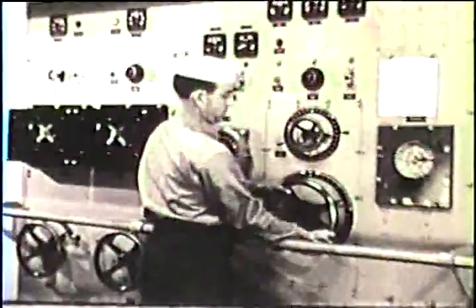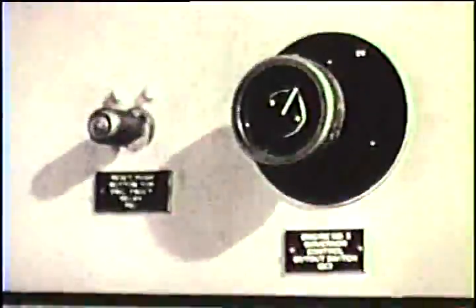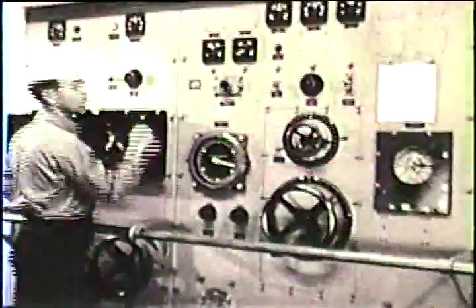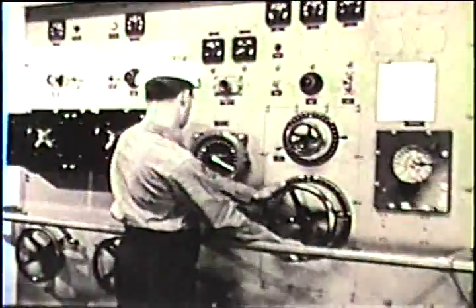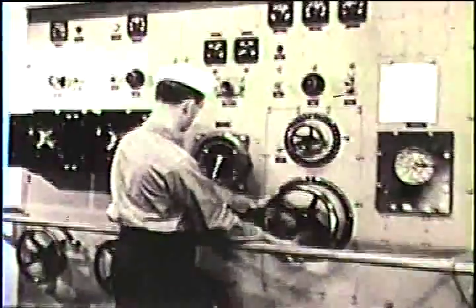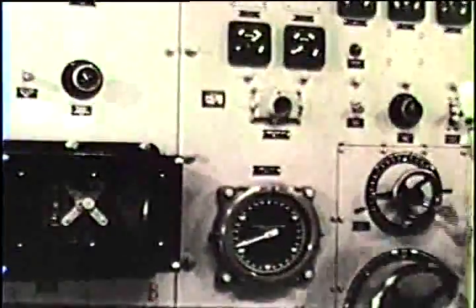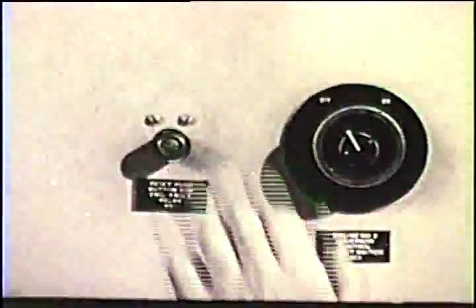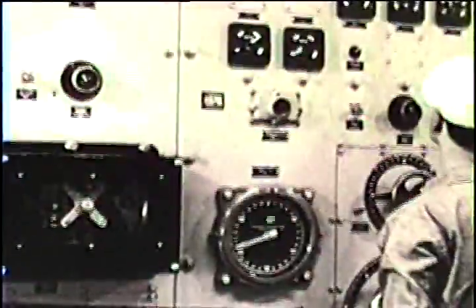Turn the speed controller to point 11. The generator transfer switch to bypass. The individual governor control cutout switch to off. And the motor field controller to the mark for 1 generator operation. Adjust the speed with the speed controller. And push the reset push button for the engine fault relay. This must be done or the generator will not deliver power when its engine is running.